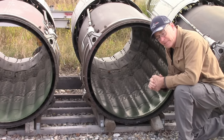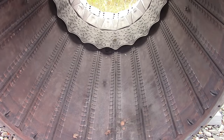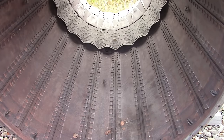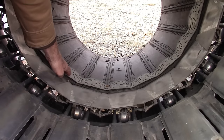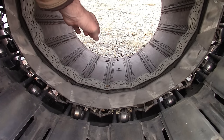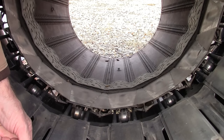Let's now come in and look at the smaller bumps from both ends. Here's the one that was last on the end — the forward section of the liner has been removed, and at the rear we can see the little dimply bumps. We're going to go to the outlet end. Here's the other end of those bumps — they're actually little flaps created by a manufacturing process. They punch a small hole and leave a cover that lets some air out. So they look like a bump from one end and slots from this end. This is how the cooling air comes out.